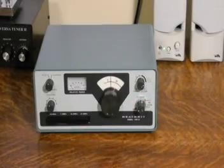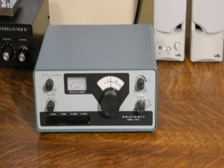The receiver is quite sensitive and the selectivity is pretty good for CW work. I rarely use the narrow filter setting unless there's QRM from a nearby station. There's no automatic gain control, so you typically have to turn the RF gain down for strong signals to avoid distortion. There's no receiver incremental tuning, so moving the tuning dial will change your transmit and receive frequency — any kind of split frequency operation is not feasible with this rig. The offset is fixed at about 750 Hz.